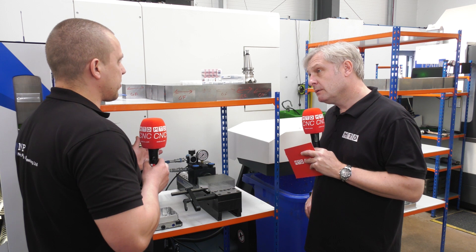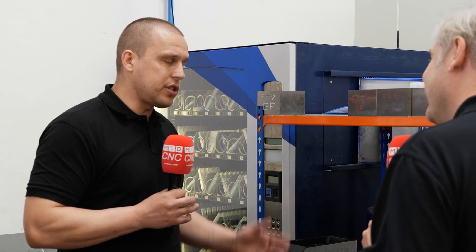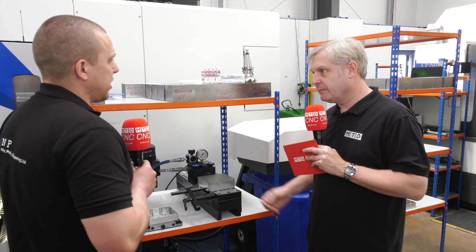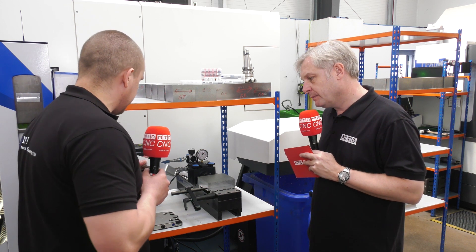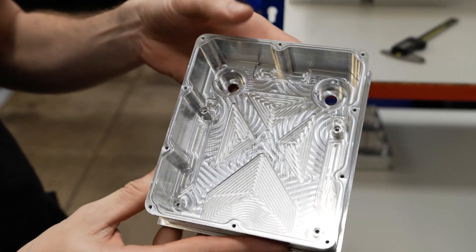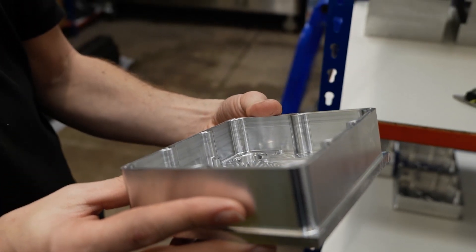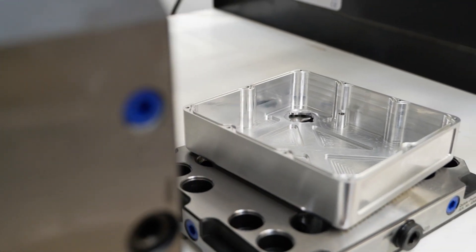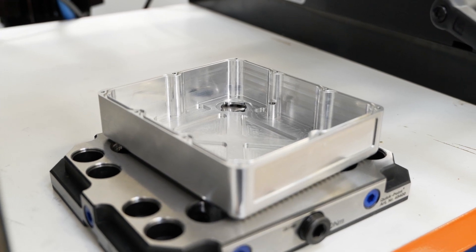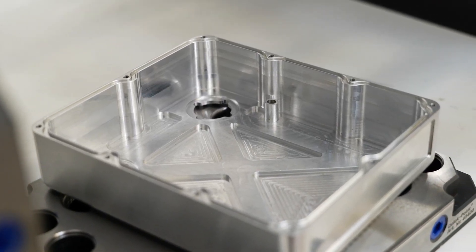Not only when you clamp the raw material do the vises give you that advantage, but also when you actually clamp pre-machined components — like a second op — they also hold the parts very flat and true. It's a really good system. So you're not stressing the material, you're getting better surface finishes ultimately? Oh yeah. We have this one example — we are using a very small tool to machine the spigots, and you might say it doesn't make a difference with something like that, but it does. In our world, any small advantage you can get pays dividends. Having the LANG system, we just started making those parts and we can see the difference in the surface finishes. The small spigots used to be a bit more rough finish. And now, same piece and speed, same tools, same machines — and it's better. It can only point to this one.